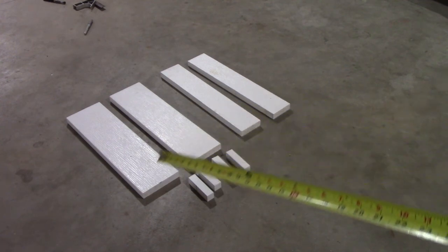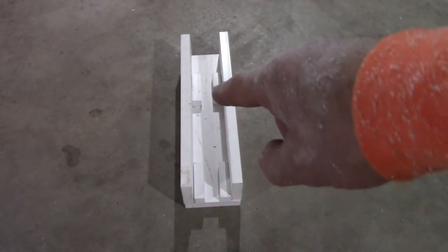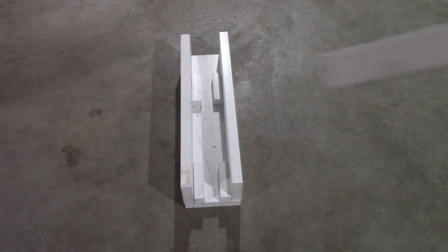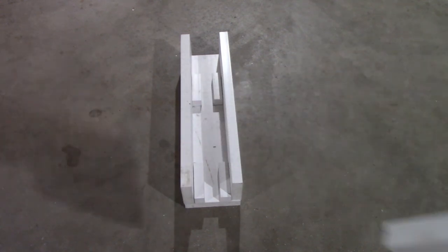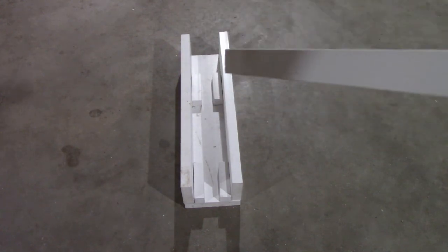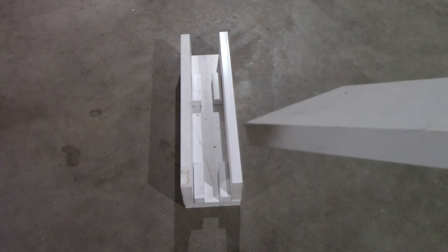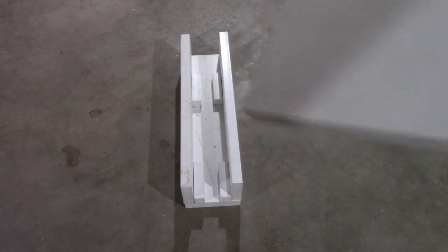Let me put this together and show you the initial stages. I've got these little one-inch blocks, four inches from the side, because this is going to slide over the top of the pole once this piece is on. To secure it - since this is PVC or vinyl - it's like vinyl siding except this stuff is an inch thick, so I'm not expecting it to expand and contract much. I'm going to glue it with the same stuff used on vinyl fencing or ABS pipe - that general purpose glue that welds it together.